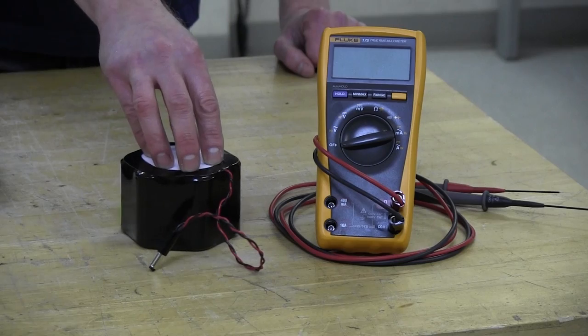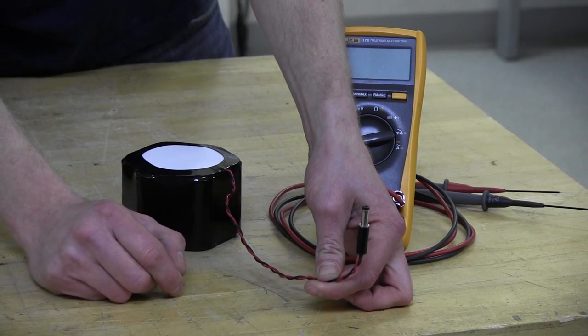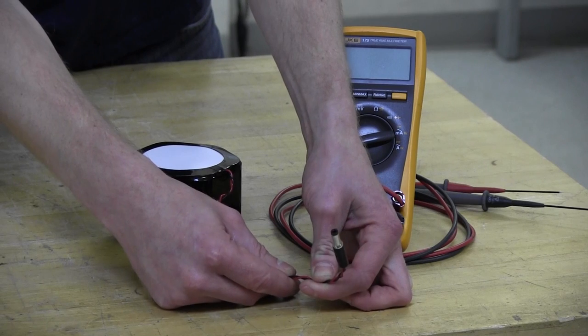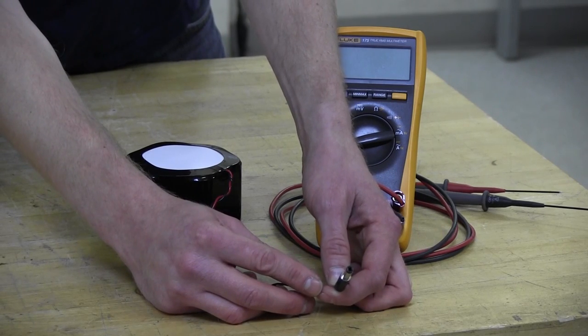This is our replacement battery for the SatLantic CFET. Following this twisted pair of conductors, we come to the barrel connector. This is what you're going to grasp when installing and uninstalling the battery — never grab the conductors themselves and pull on them. You could damage the barrel connector, or worse, you could damage the female jack that's inside the internal battery compartment.